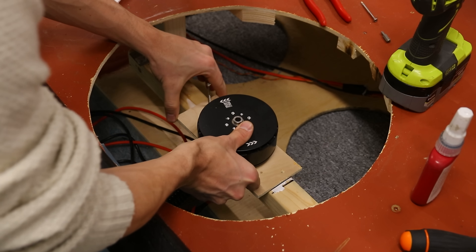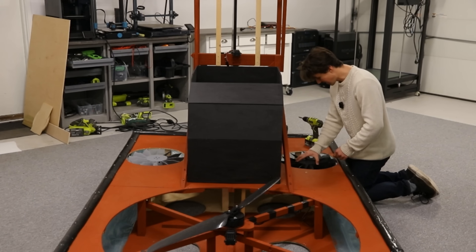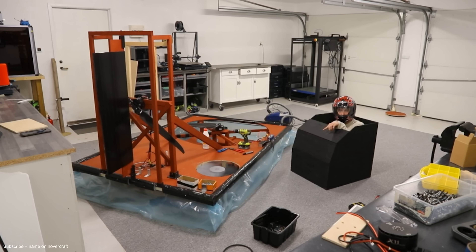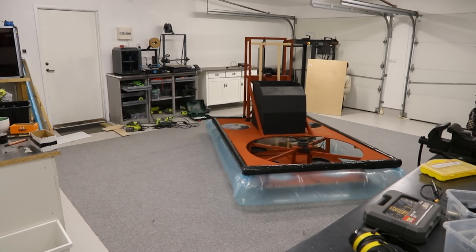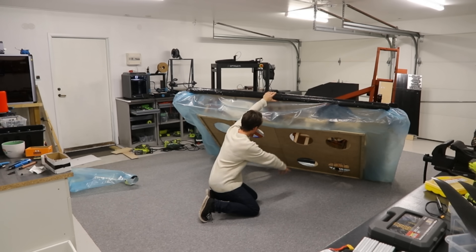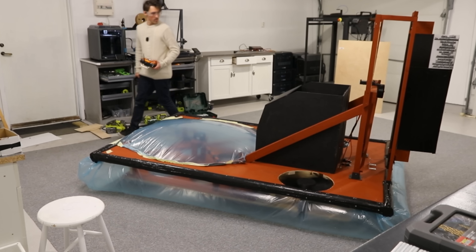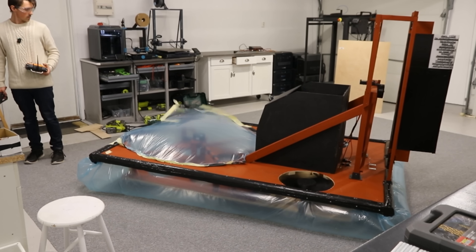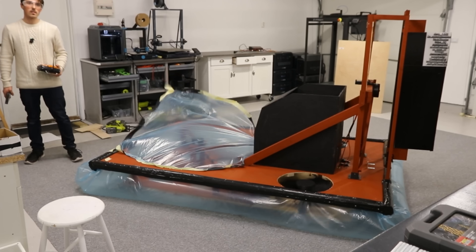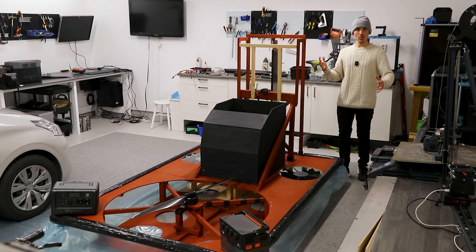Both propellers were in place and it was finally time to test it, but I immediately found a problem with the current setup. Look at the plastic — it's not pressurized. It did in fact still work, but I had to use way more throttle to keep it hovering. What happened was that air was allowed to escape from the carbon propeller inlet, which rendered the new EDF propellers pretty much useless as they couldn't build up pressure — which was super clear when the pressure managed to tear the stapled plastic after I plugged it.